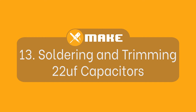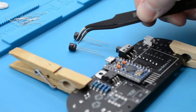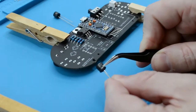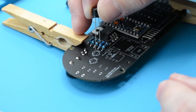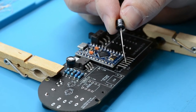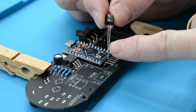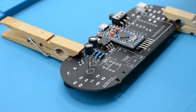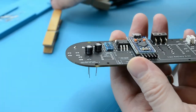Fitting and soldering the 22uF capacitors. There is a long and short leg — the long leg should align with the white positive sign on the PCB. There is also a pattern on the capacitor above the negative side; this pattern should be facing towards you when you fit the capacitor. The longest leg goes into the furthest hole from you and the shortest leg goes into the closest hole, with the pattern facing towards you. You should see that same pattern above the shortest leg — this pattern should be facing towards you, so fit it on the PCB with the longer leg in the furthest hole and the shorter leg in the closest hole. When both patterns are facing towards you, the capacitors are in the correct position.